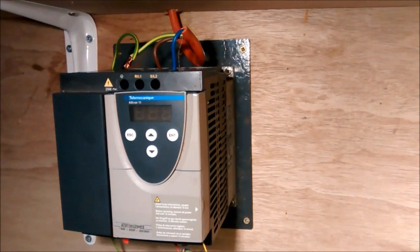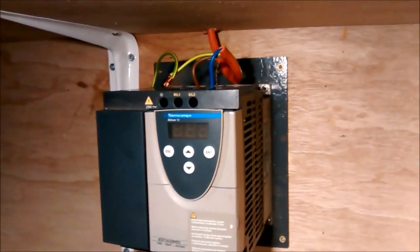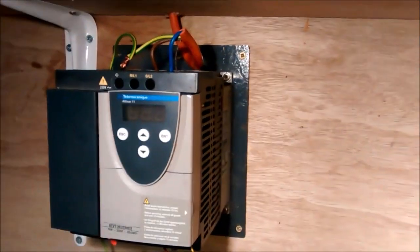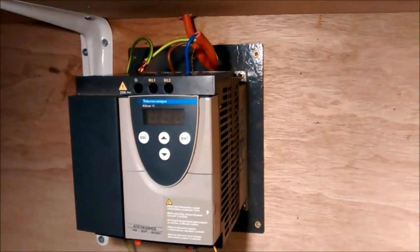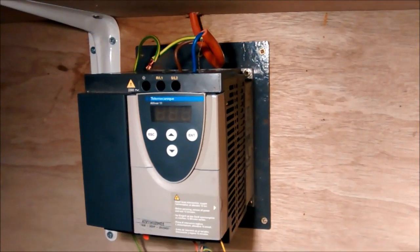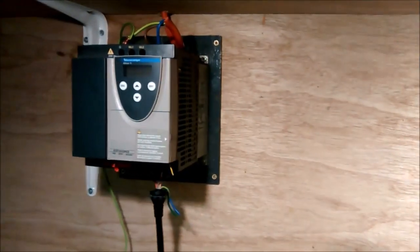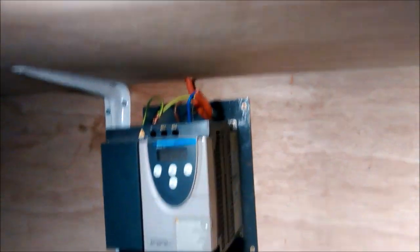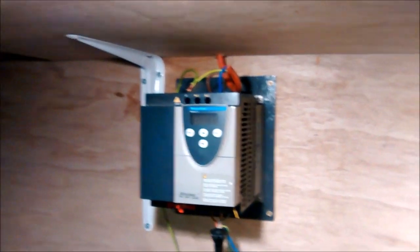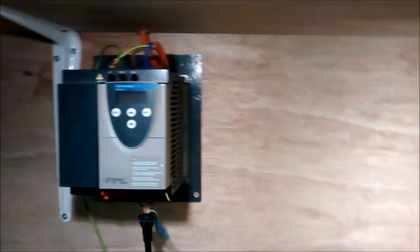but I don't want to do that. And then the alternative solution, if it works, is to have an isolation transformer between the mains and this, and then sort out the protection this side of the isolation transformer. And that's going to cost minimum of £100. Can't see any isolation, you know, because you're talking about quite a high current transformer. Just a one-to-one isolation transformer. A one-to-one transformer that will take a few amps, and it seems they're not cheap.